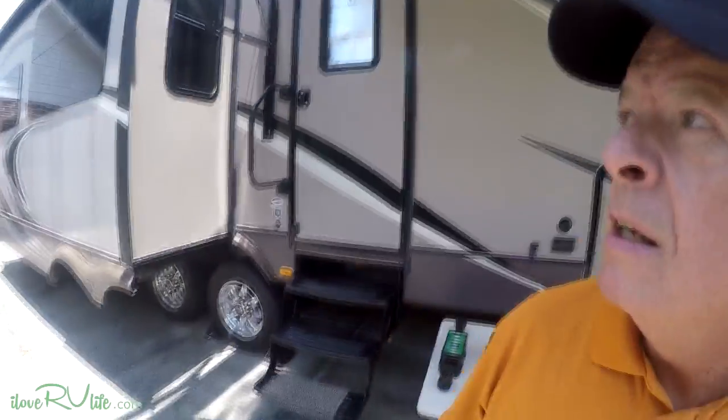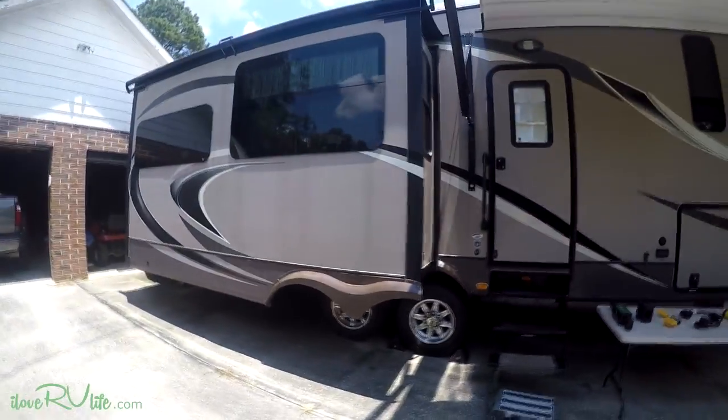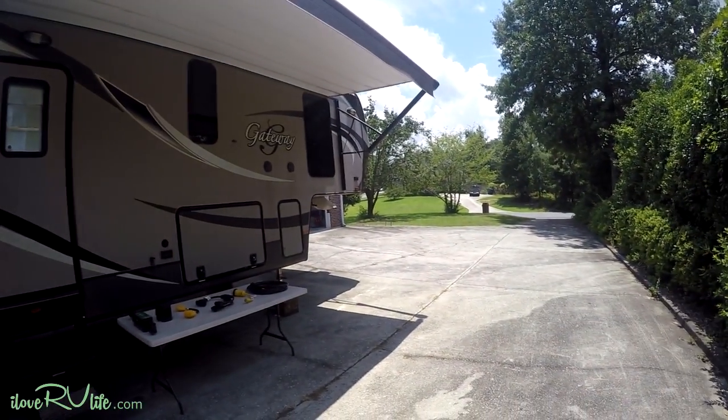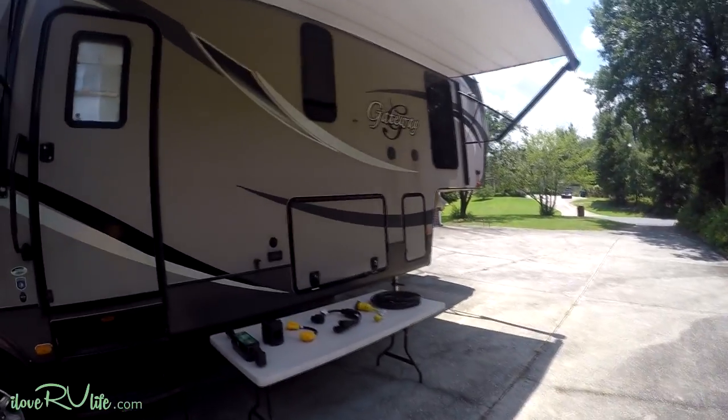Today's video is going to be specifically for 50 amp connections, but the same rules apply if you only have a 30. You don't have quite the limitations on a 30 that we have on 50. As you see here, this camper is 40 feet, and with a 40 foot, we have 2 air conditioners. So we've got 15,000 BTU up front, and then we've got a 13,500 in the bedroom. To run both of those, you need 50 amp.